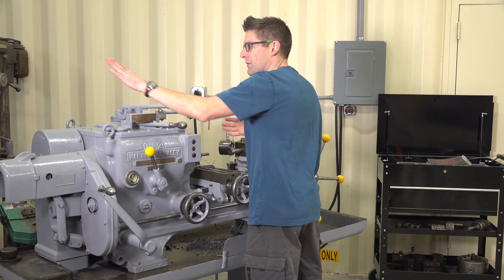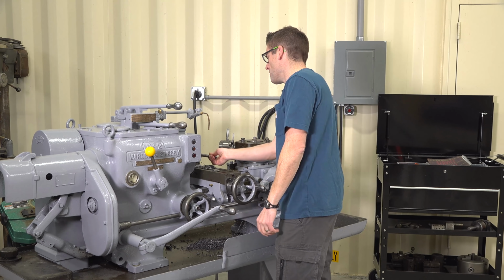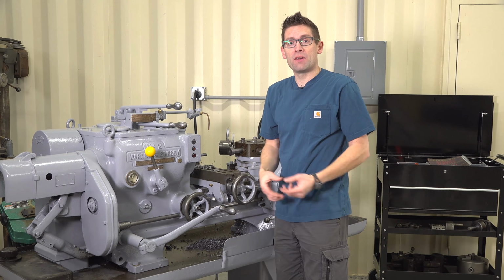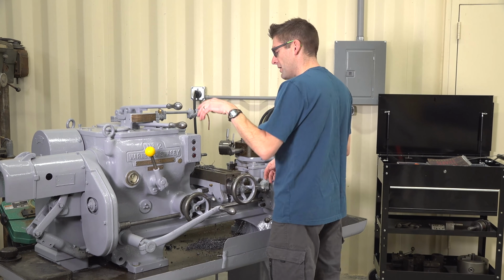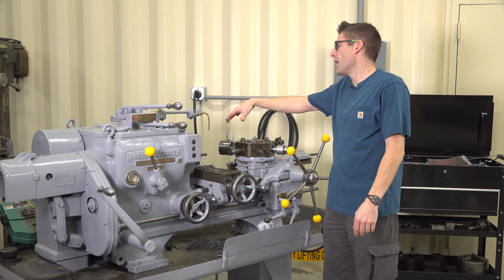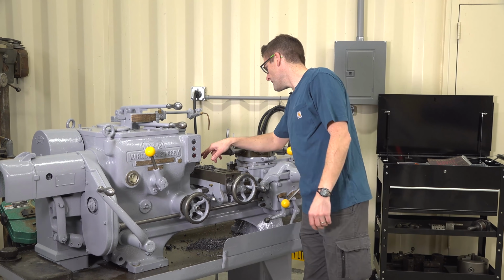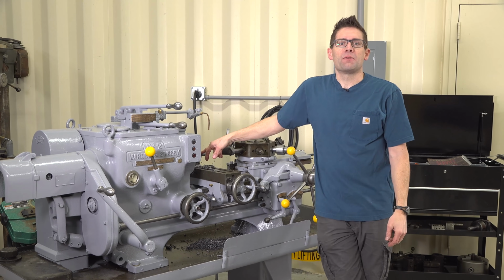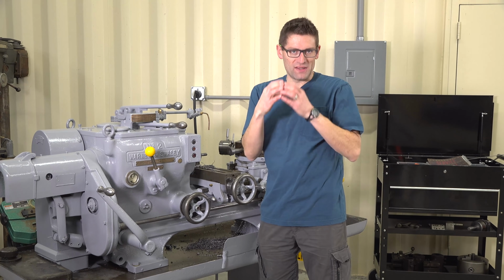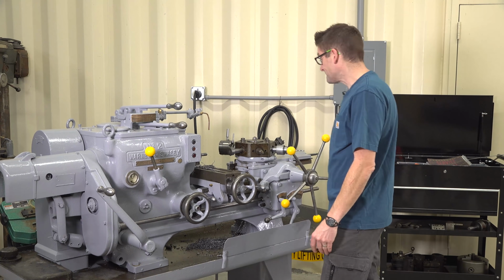This kind of machine would typically use a bar feeder, where you unclamp the work and then pull it through a system called a feeder, like a ratchet bar feeder or an electric or hydraulic feeder. The work is reclamped and then a series of operations is performed on the work. Here I've got what looks like 5/8 round bar that I'm clamping with a collet. Collets are great because they hold the work concentrically and you can really quickly release and reclamp the work.